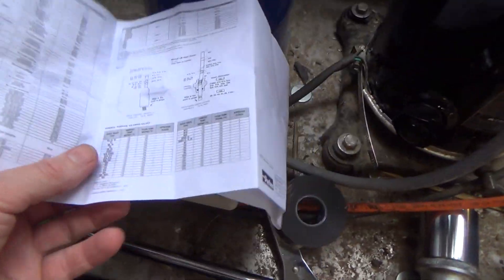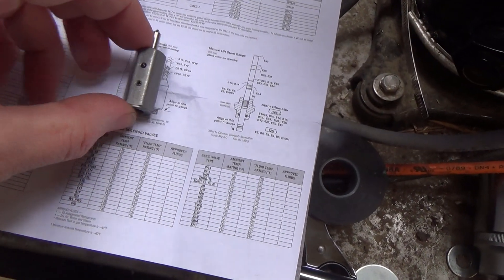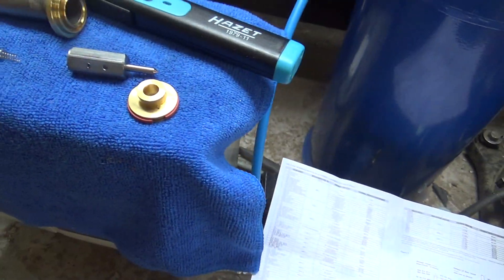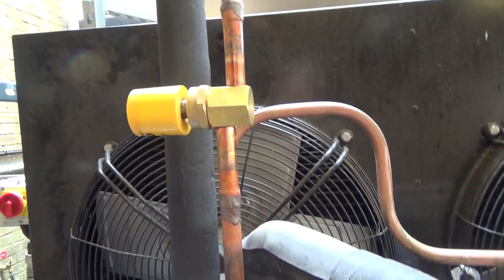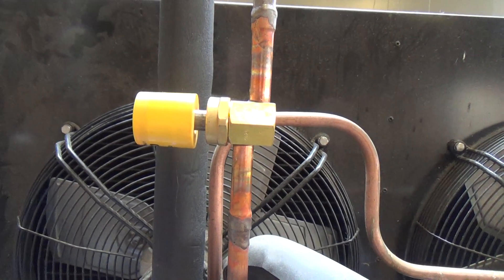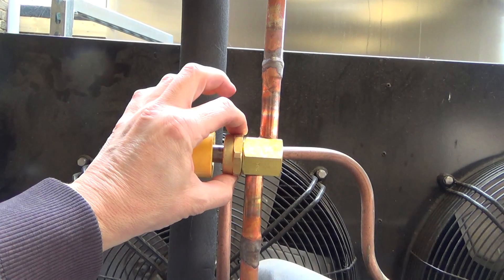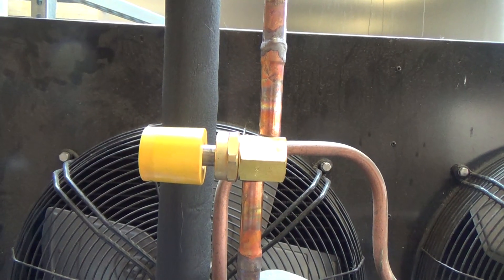There's a chart for checking this plunger but I've not made any sense of that. And that pin is a floating pin, so I suppose that's normal. Got that back together - didn't really find anything conclusive in there. From the instructions I've got to confirm I can mount it this way. I'm pretty sure you could mount them horizontal, or ideally with the core stem sticking out. But the other issue could be if this is oversized - there's not enough pressure drop across the valve for it to actually shut, because it relies on the gas pressure to push the seat shut properly.